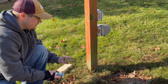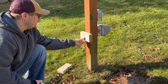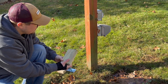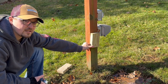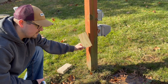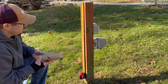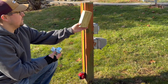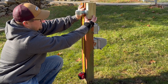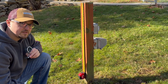In order to fix that, I was going to take a little strip of two-by-four that was a cut-off from a previous project. I was thinking about putting it on the side of the column — I think that's a little bit cleaner, less material sticking out. For mounting, I want there to be a holder about four inches from the top, and then another one down at 16 inches from the top, so there's about a foot between the two holders holding this vertically.